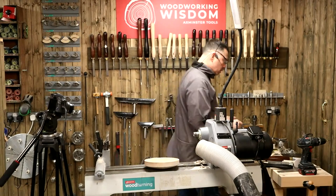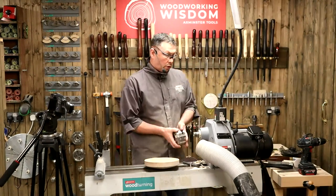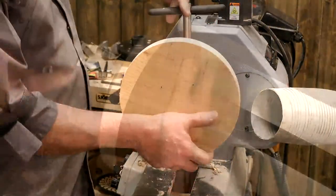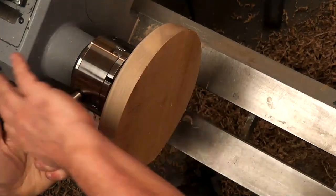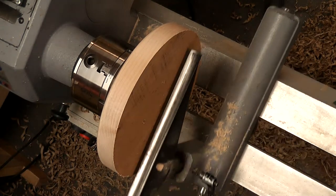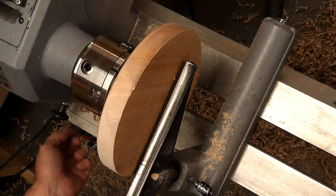There we are. So let's just do a little bit more turning now. I'm going to put the C jaws on, and the SK114 chuck. We'll take the inside out, and we'll make the beads and we'll stop there. I'll finish it and Ben can pick it up tomorrow with the decoration. So at the moment, it's far too wide, so we'll just take away some of that depth.